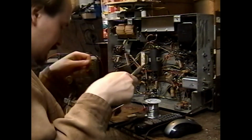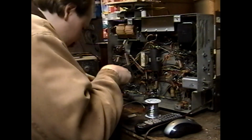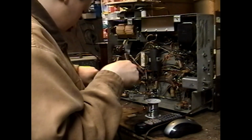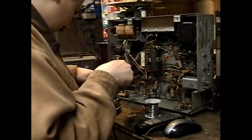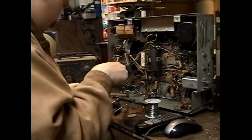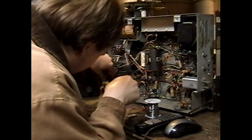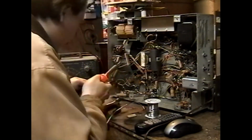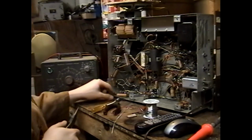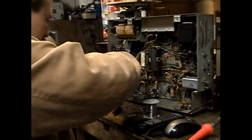So what you're telling me is that you layered capacitor wiring two layers deep, so I have to... Okay, well, we'll test this other capacitor that's on the same terminal while we're in here, since we have to unwrap it just to get the old capacitor's lead out. There we are. The old 0.1 is completely unhooked and removed from the terminal strip.